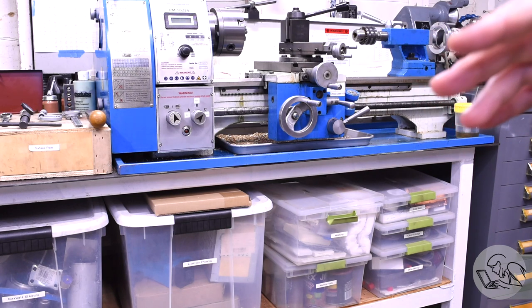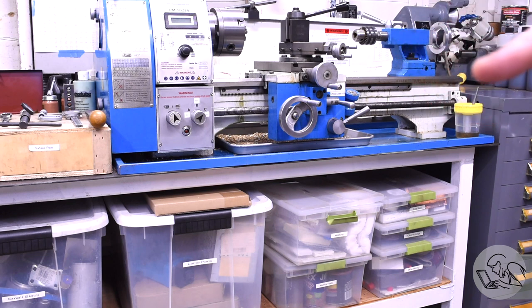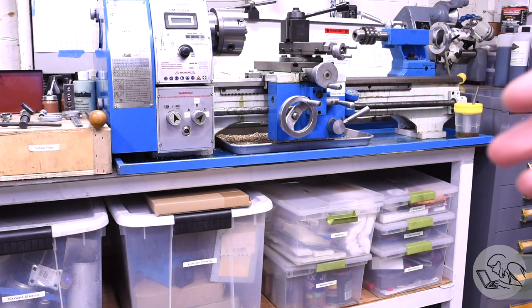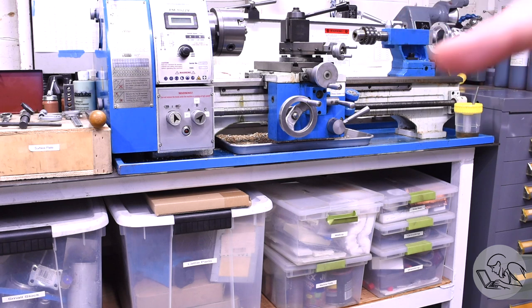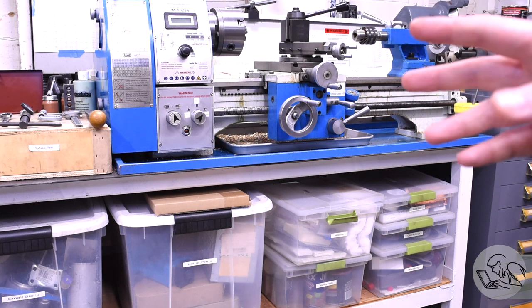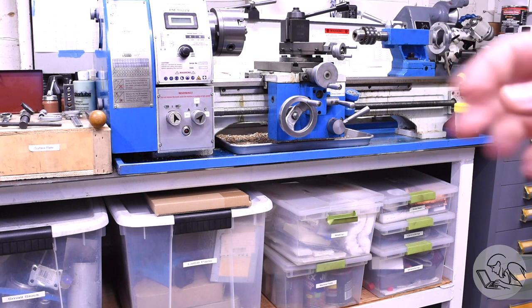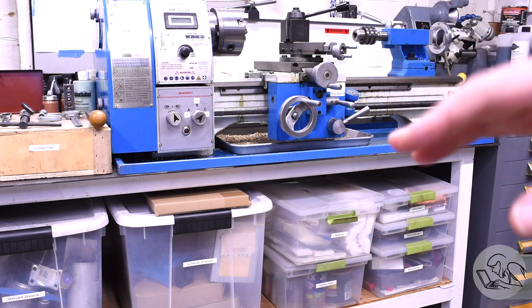A lot of people ask: can I bolt my machine to the top of one of those rolling tool cabinets? Honestly, I don't know — I've never tried that. My inclination is that it's probably best not to bolt a machine tool to something that rolls. If the cabinet has really good wheel locks on it, then it's probably fine. I think the bench tops are usually laminated maple, so that's probably pretty stable, but I'd definitely keep a closer eye on my bed level if bolting it to wood. But again, we're probably chasing diminishing returns. People have been bolting lathes to wooden benches for hundreds of years, and it's fine. So I wouldn't stress too much about that.